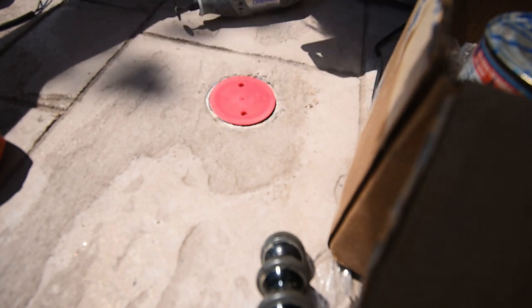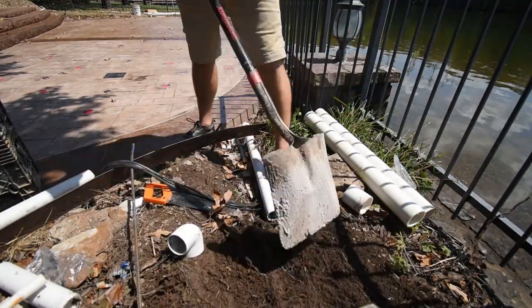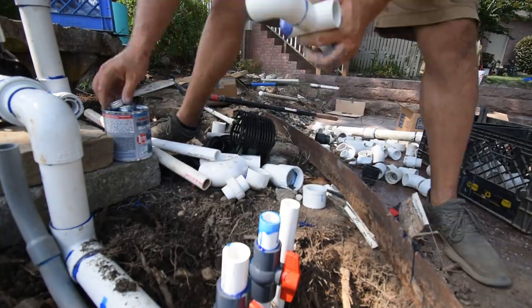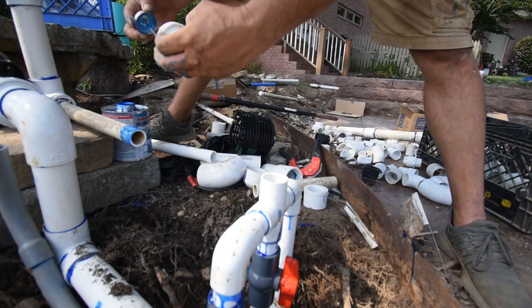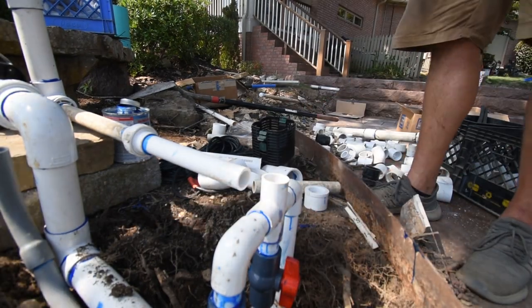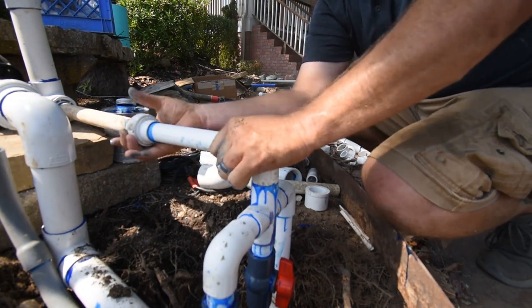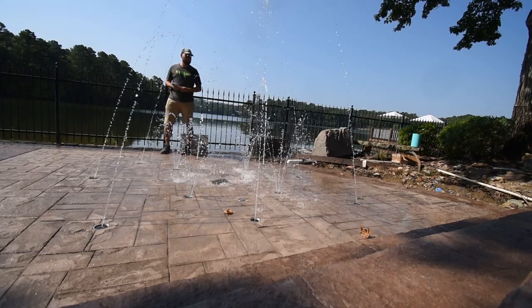After the nozzles were set into place, we grouted them in and had them set permanently. Once the lights and nozzles are in, the patio is ready to be washed and sealed. After sealing, we hook up the plumbing — a two-inch intake line plumbed into our centrifugal pump, then an inch-and-a-half output line reduced down to one inch, running into each of our valves for zones one, two, and three. We use the one-inch conduit that was run with the drainage to hook up the electrical. This won't happen until the kitchen is finished, since we're putting a switch in the kitchen so they can turn the splash pad on and off. After that, we plug in the pump and we're ready to play.